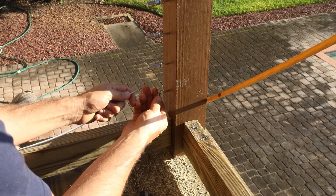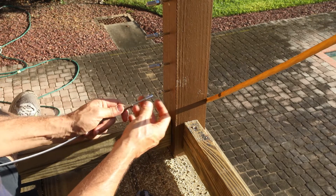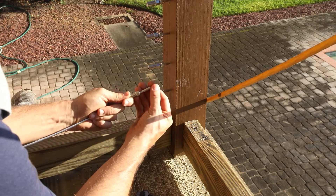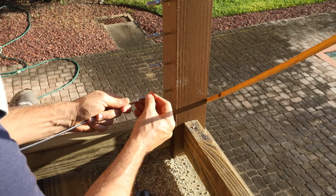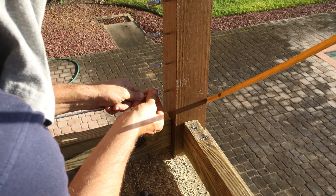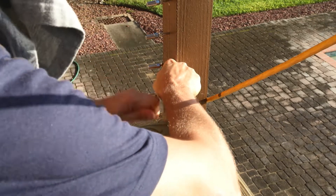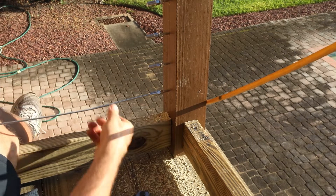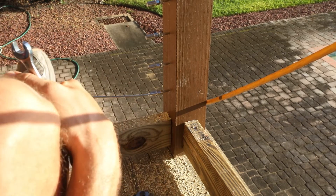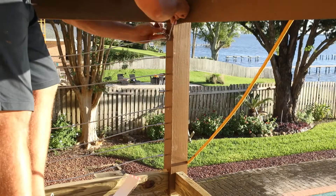On the stud side, I remove the cone and wedge, place the cone on the cable first, then the wedge. You have to be careful of the washer that often stays on the stud — carefully thread the washer onto the cable and push the cable into the stud. Hand-thread the cap into place, then further tighten using two wrenches. Make sure you are clear of the cables when you lock them in so you don't tie yourself in. Repeat the cable attachment process for each cable.